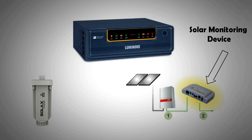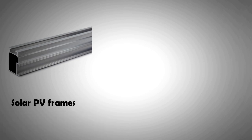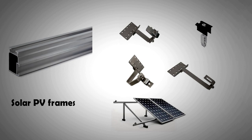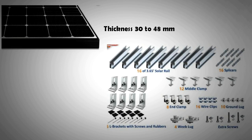Let's focus our attention now on installation and tracking technology. Ten years ago there were limited options for roof racks and rails to install solar panels. Today there are a variety of options for all kinds of roof structures that make installation quick and easy. There has been standardization of solar panel thickness — most panels are now between 30 to 48 millimeters thick — leading to the development of roof attachments, mounting fasteners, and racking systems that can cater to all types of panels in the market.